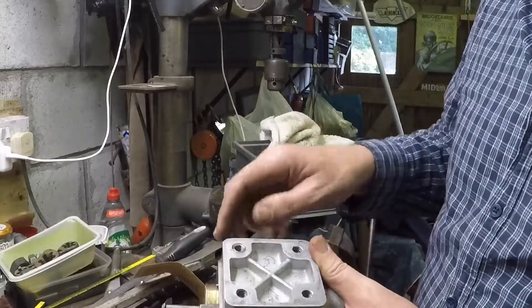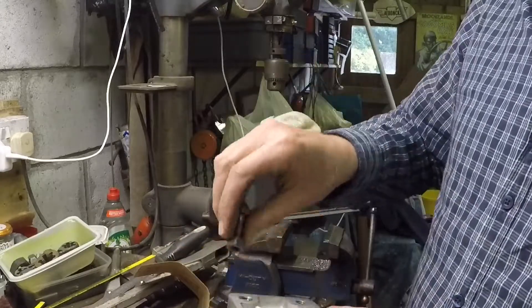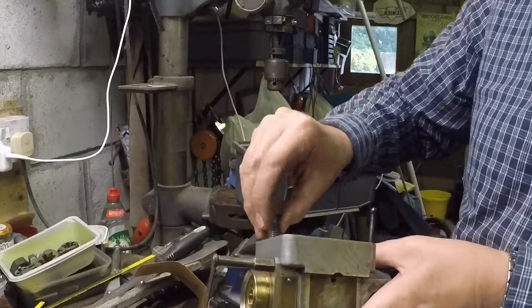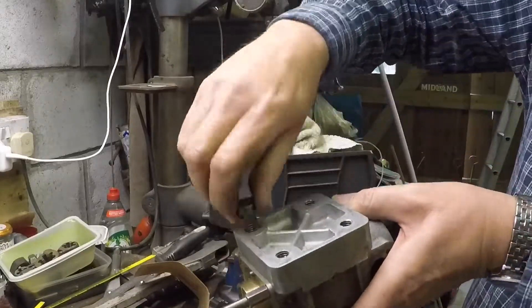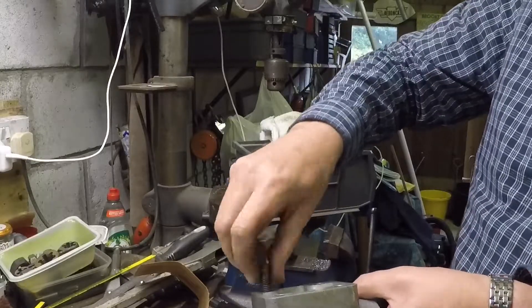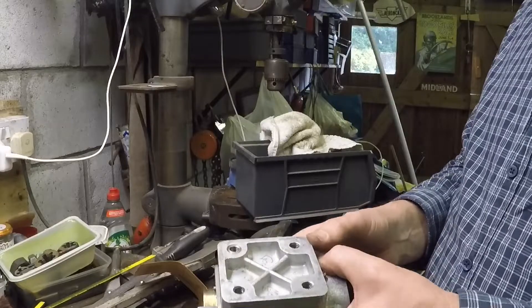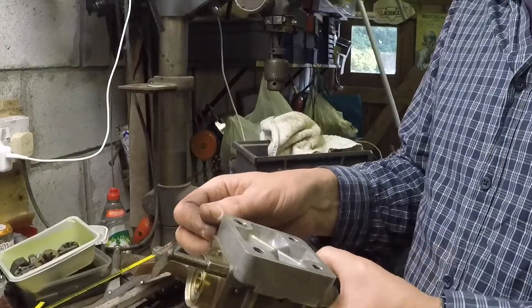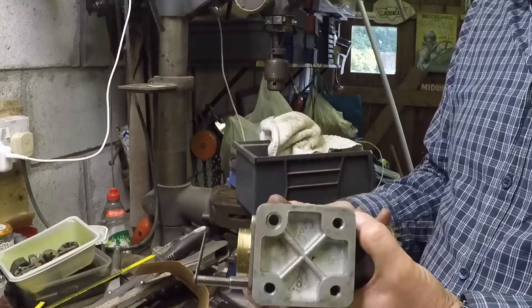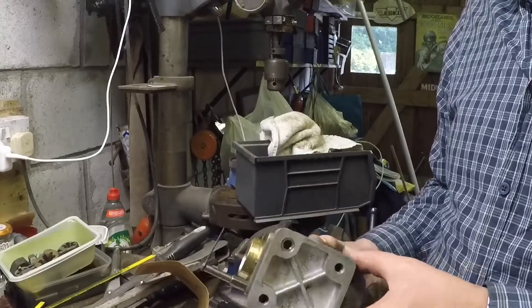I faced it off in the lathe — I held it in some tape and then put it on a bolt with a nut, wound it in, and it sat in there as flush as anything, and now I can't get it out. So that's fixed — that's perfect really. It takes a bolt; one of the long bolts that holds the advance-retard mechanism and goes through the engine case into a steel fitting — a nice tight screw fit into the parent aluminium — and is flush so the mag will sit down firm. It disappointingly worked out very, very well. So the next thing is to try the mag on an aeroplane at some point. At least I can take it with me as a spare now — it's a fully serviceable mag, which it wasn't before. That's been a complete success.